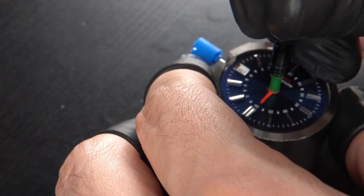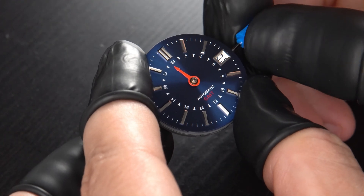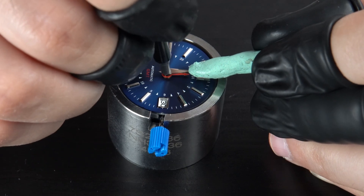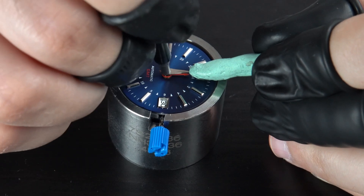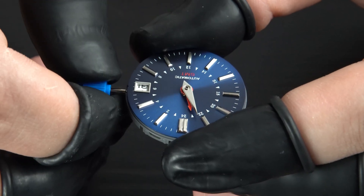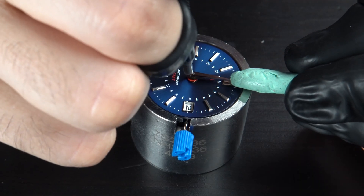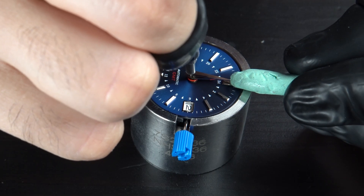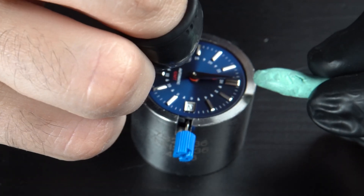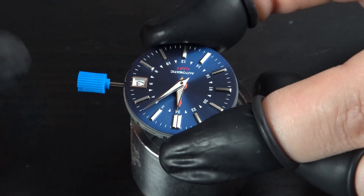I stick the tip of the hand to a piece of rodico, line it up with the 12 o'clock index, and press it in place. After that I check to see if the hand is rotating properly. Next goes the hour hand — I went for this beautiful set of sword hands with a very nice brushed finishing. The hour hand is installed the same way the GMT hand is. It's important to rotate the hands and make sure they are getting along before moving forward. The minute hand goes next, relatively easy to install. At this point I am using a loupe strapped to my head — it looks ridiculous, but at least I can install the hands quicker and not lose my sanity while doing it.